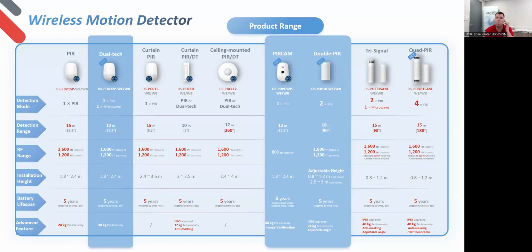There's quite a bit, like I said, your normal PIRs with that creep zone detection, the different measurements that it can handle for certain areas or distance that it can communicate. It also has its built-in battery that can last up to 5 years, depends on how many times it gets triggered. It shows you there, trigger up to 20 times per day. That's 5-year lifespan, which is brilliant. A lot of the other equipment is even longer, like you can see 6 years on this one. My mouse is very slow on this PPT, which means it might crash on me. So let's just keep it there.